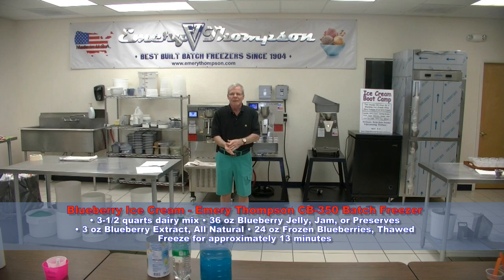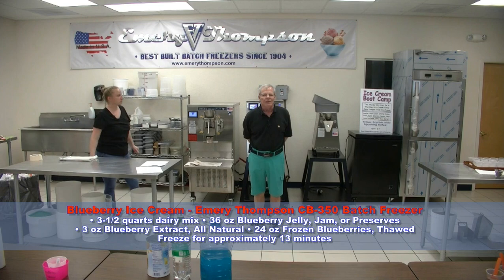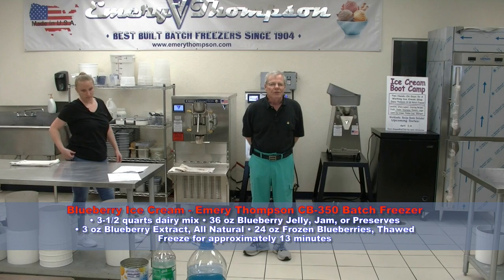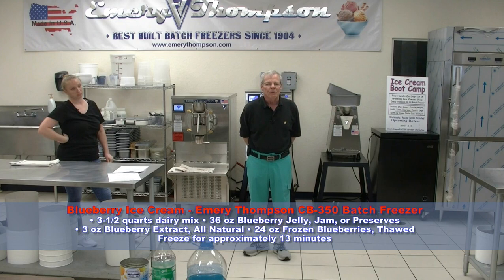No? Okay. Yes? Do you sell a tune-up kit? No, we don't. Do we sell a tune-up kit? No, because tune-up kits are not necessary. It depends on how often you're running it. There's no sense selling you springs if you're making ice cream or ices twice a week. I mean, they're going to go for a long time. We sell individual parts. We know what you need. So when you call up, rather than charge you $400 for a quote-unquote tune-up kit, we're going to sell you $14 O-rings, because that's all you need. We'll sell you what you need.